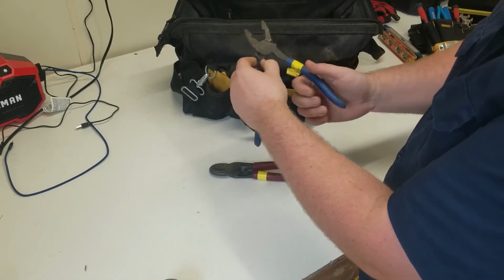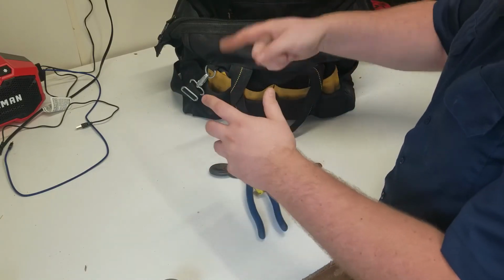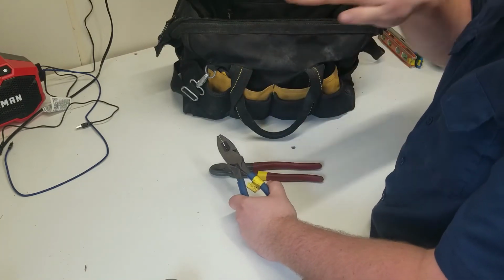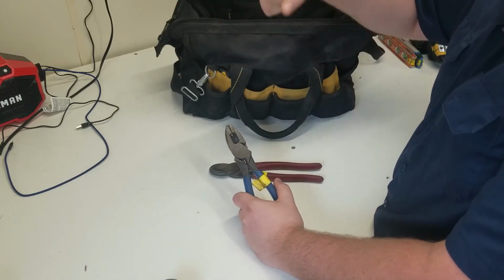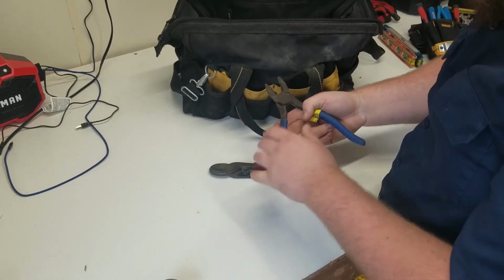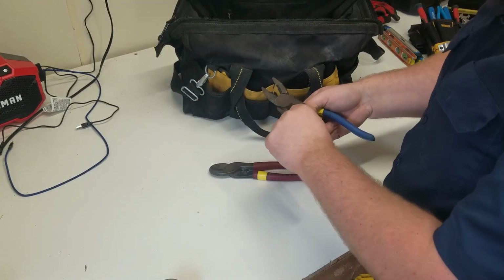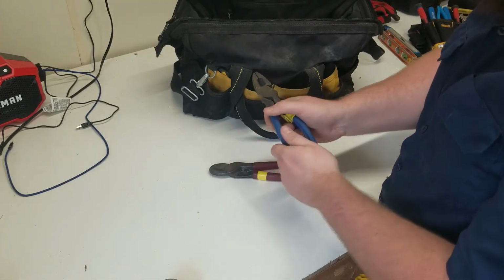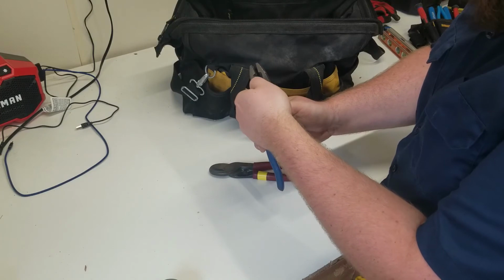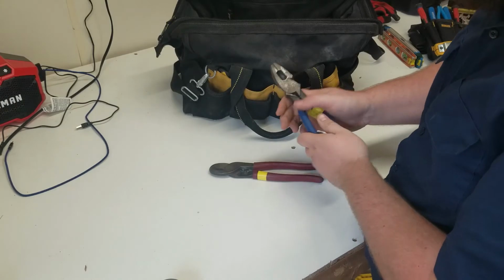What that's for is we use something called a fish tape. And it's this big spool of, well, in this case we're talking about metal, which is this flat little piece of metal, and you push it into a conduit, comes out the other end, you put the wire on it, and then you pull it back and it pulls the wire into the conduit. Now with metal, which are historic, now I make them out of fiberglass, which are a lot nicer most of the time. Every once in a while though, you'll use a metal fish tape, and what this is designed to do is you open it up and you can slide that metal fish tape in there and then close it down, and that fish tape will bend around. And that leverage gives you a lot more to pull on as opposed to a tiny little piece of metal. So these are really great.